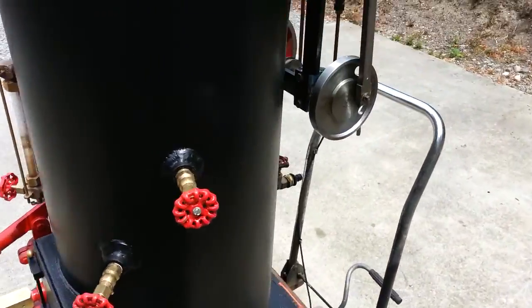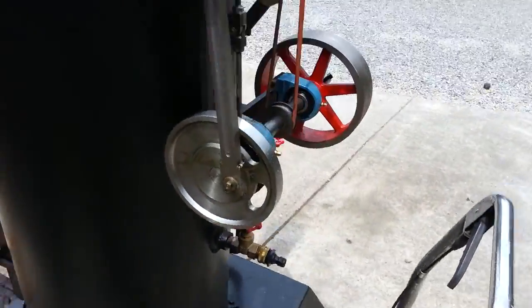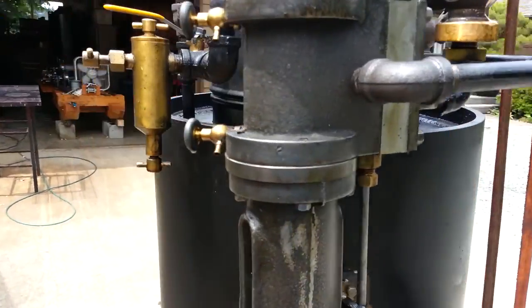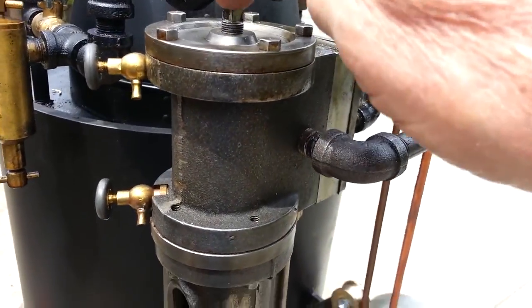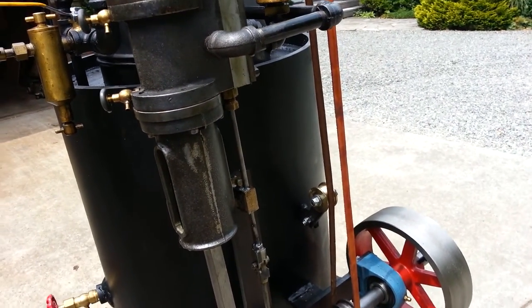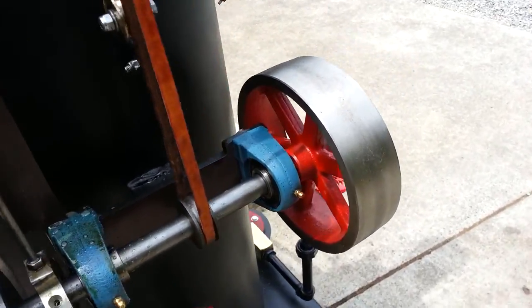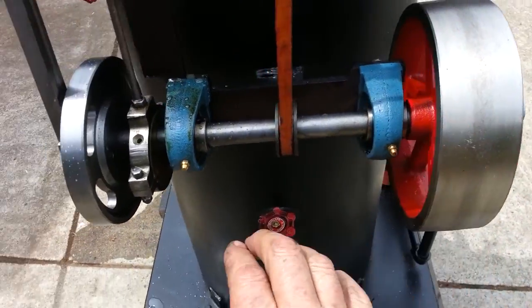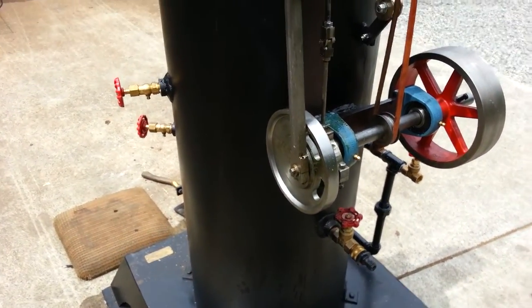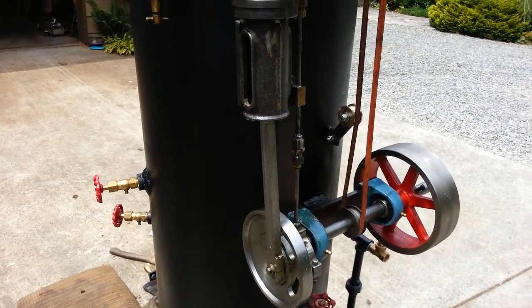The engine, of course, needs to be oiled a little bit on the outside and the inside. You can put oil right into this little plug right here and run the engine up and down a couple of times by hand. Just oil up everything — the flywheels and the crank disc — and make sure there's a good coating of oil on it. Wrap it up in plastic.